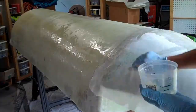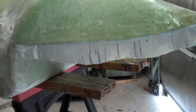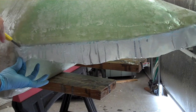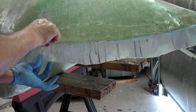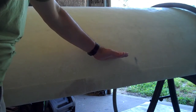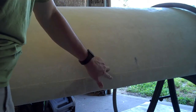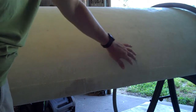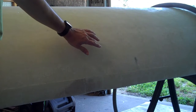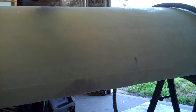You can see that the woven fiberglass cloth goes almost transparent once the epoxy is applied — this is the type of fiberglass you would use over a cedar strip canoe to show off the wood underneath. I'm using it as a final layer that will be covered by the polyester resin gel coat. My woven fiberglass cloth comes down to about here and I have chop strand mat up here — a double layer where it's folded over from the top. That's obviously less smooth, but I'm not too worried about that because it's going to be above the waterline. I'm really focusing sanding efforts on the bit that will be below the waterline.